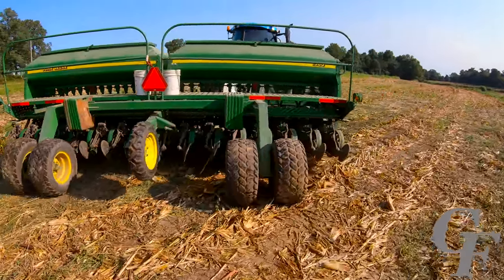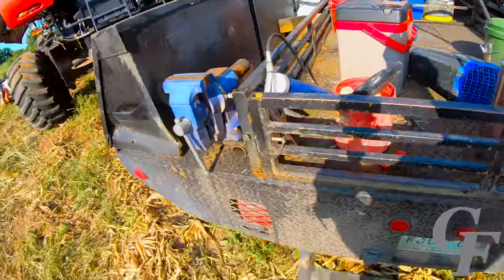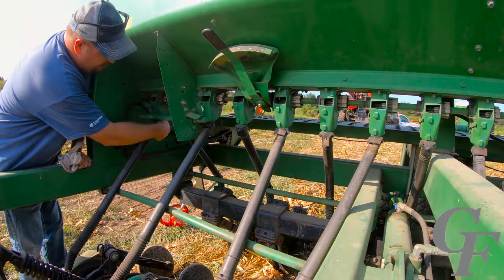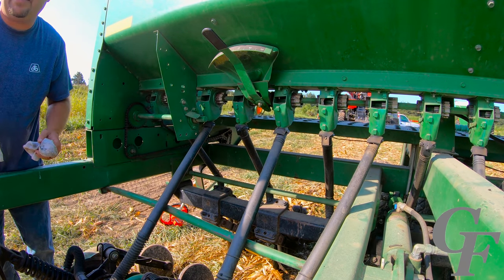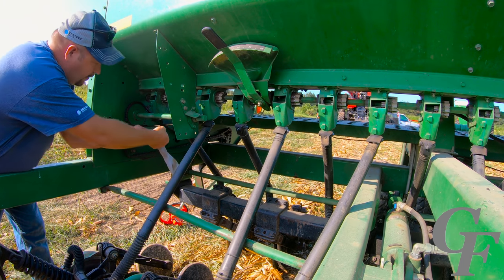After you run just a little bit of seed through the drill to get your meters slicked up, go ahead and set your drill down in the ground and then stop. What this does is get your drive already engaged so there's no lag once you start catching the seed. Then grab all the stuff you need and get it set up on the drill. Take one of the seed tubes off on each end and use a rubber band to attach a sock to it to capture the seed.